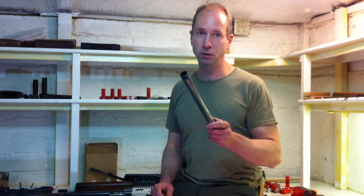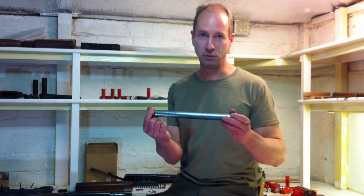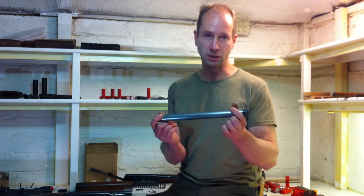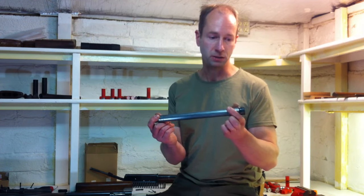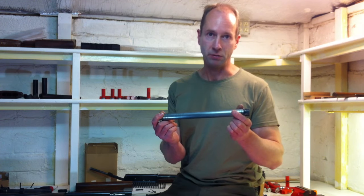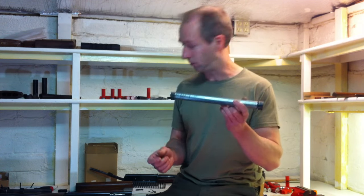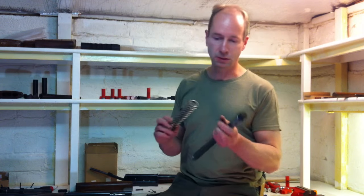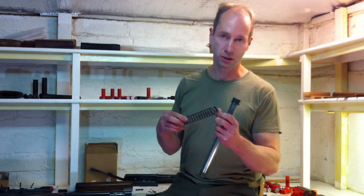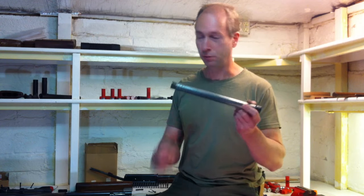The magazine tube, which is bearing all the stress, is screwed in the receiver tube here, and then it's the barrel slamming forward, slamming against the wooden handguard, and the wooden handguard is slamming against that end cap. So all the stress is going on that receiver tube. And there are some very deep scratches in that original receiver tube that probably come from some improperly manufactured spring that has some sharp edges here. So this will develop sooner or later cracks here. Replace that one.